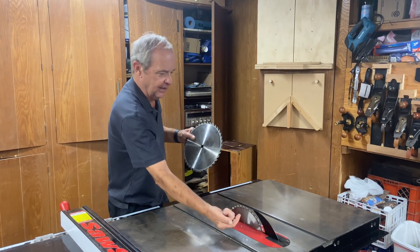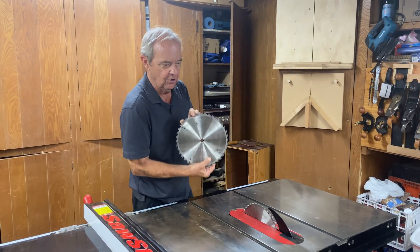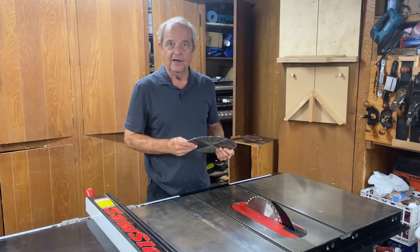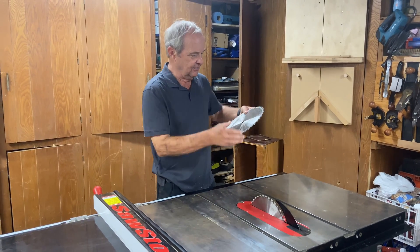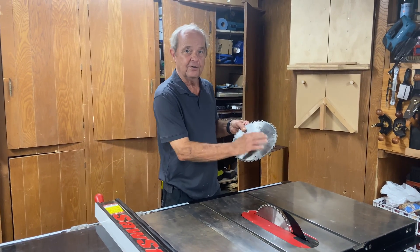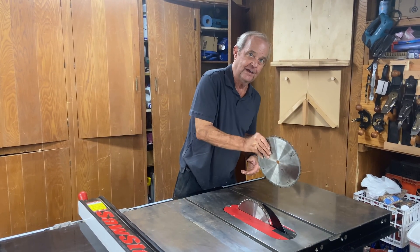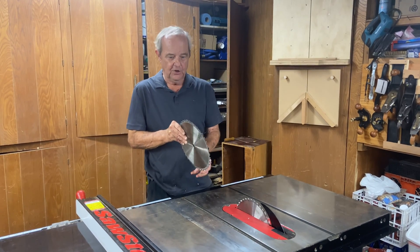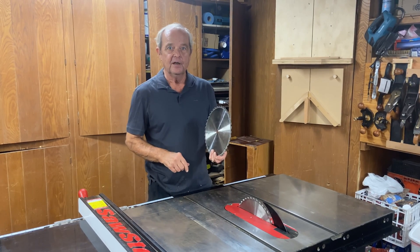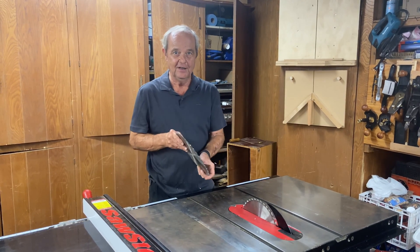You want the sharp part of the saw blade coming into and down through the wood, so you always place the blade with the sharp side coming toward you. In the industry it is standard to print the lettering about the saw blade on the surface that goes on the left-hand side of the arbor — so sharp teeth toward you, because that's the way it always spins. If you like the video please hit like, and hit subscribe if you want to see future content.